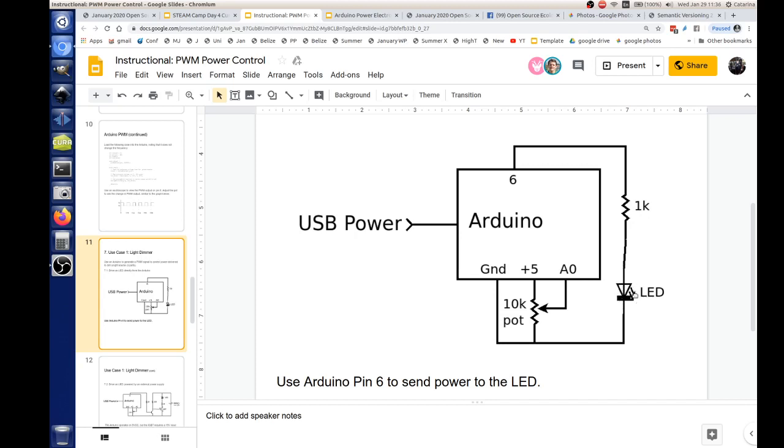Now the LED itself, when you forward bias it, and that means you put plus voltage on one side and the other side to ground, then at normal output, when the LED is turned on, it needs a current going through it of somewhere between around 1 to 20 milliamps. That's typical of these little, super bright dome LEDs. The resistor above it is selected in value, 1K, to limit the current going through the LED.